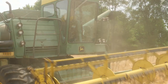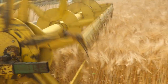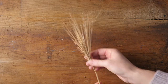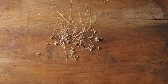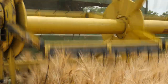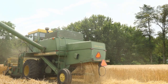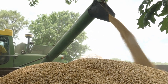This combine is by far the newest piece of equipment we have, and it's 40 years old. The combine harvester is a familiar feature in Iowa's fall landscape. It performs three functions, taking a lot of the work out of preparing this grass for consumption. First, it does the reaping, which is the cutting and gathering of the plants. Then the threshing, removing the edible part of a grain from the husk and straw. And finally, winnowing, or separating the grain from the chaff.